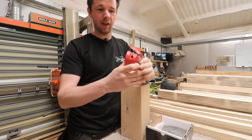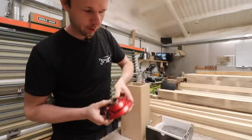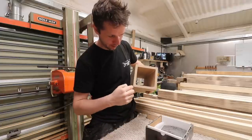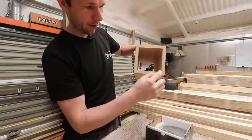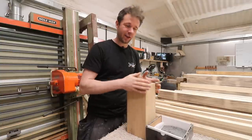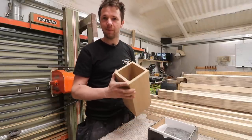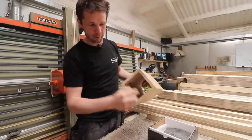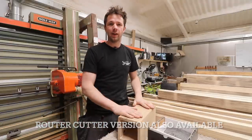This cutter actually has a little tooth in the joint profile — and this is the important bit — which allows you, when you've machined this in the two orientations, to clamp that joint together on the two 45-degree corners across the board. So you can have a clamp across there and it will pull the miter nice and tight, which opens up all sorts of opportunities for boxing in and boxing around steels on site accurately. For long sections like we're doing today it makes the clamping process really easy.